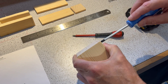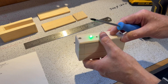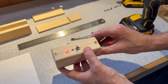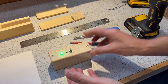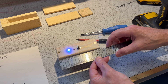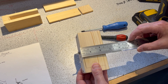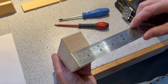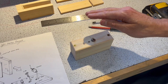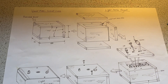I could give that a little bit of varnish to stop it getting dirty. I'll screw that down a little bit further to get rid of that mark. There it is in the case — a little bit of a gap there I can probably sort out with a little bit of sanding. It works well in the light — look. The next clips show a summary of how to make it and the tools. Size-wise it's about 120mm — I'd actually make it slightly longer, 130mm — and you need a piece of timber at least 65 to 70mm deep and at least 38 to 40mm wide, otherwise you can't fit the battery.